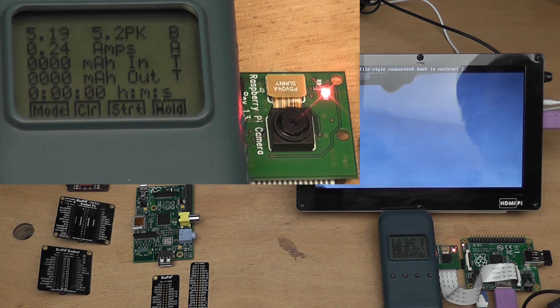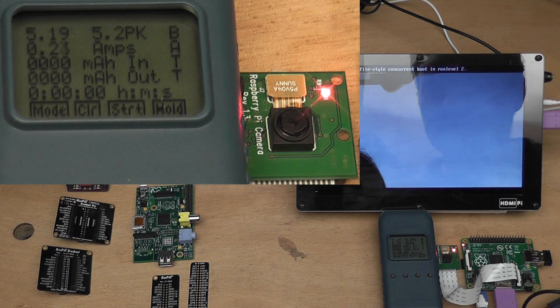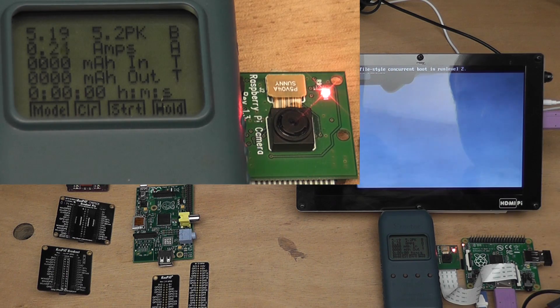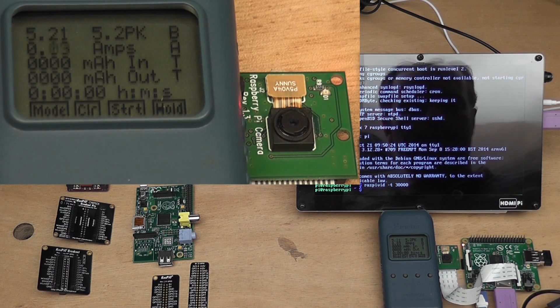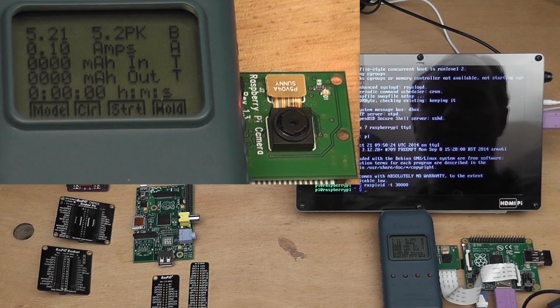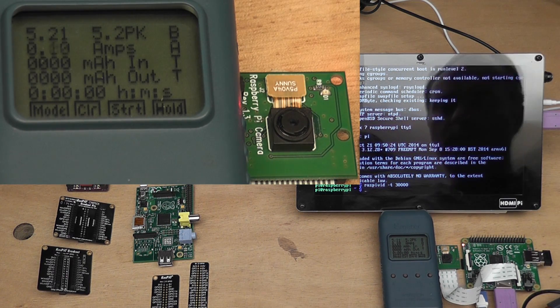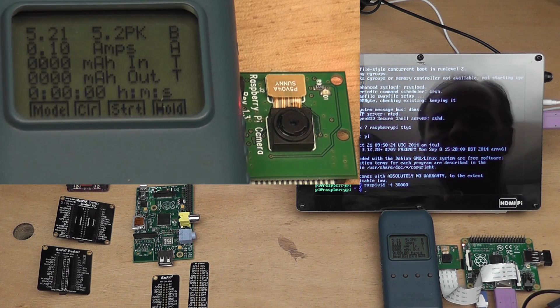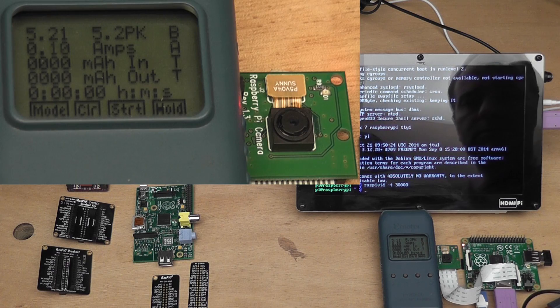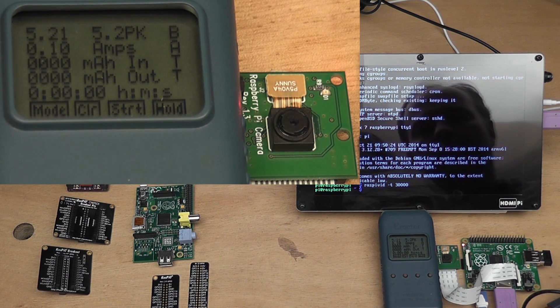On the E-meter — the bench PSU is fluctuating between 0.2 and 0.3, but the E-meter is averaging that. It's stopped now and stabilised back down to 100 milliamps. So it uses about 0.24 amps — 240 milliamps when filming with the camera. About 100 milliamps when idling, and about 130 to 140 milliamps when showing 1080p video — with nothing apart from a keyboard dongle plugged in.